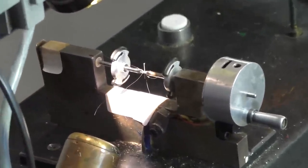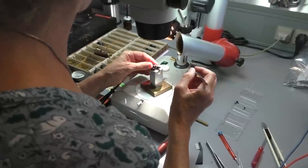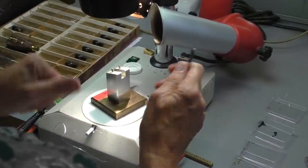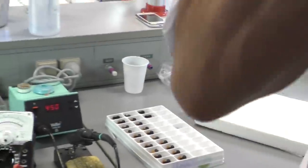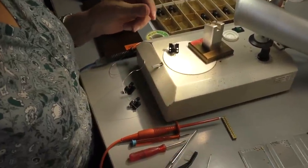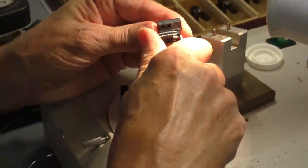So if you start out with the microscope over here, you can take turns and have a look in the microscope. Then you can see how it looks with the cantilever and the armature and how it's wound with the coil wire. So the suspension, the size, the components, together with the pressure, gives you the total compliance. So it's not only the rubber itself. You don't always need to develop a new magnetic system from scratch. We have a lot of really good ones, and this one was really good for this purpose, so we adjusted it to have the right sound.